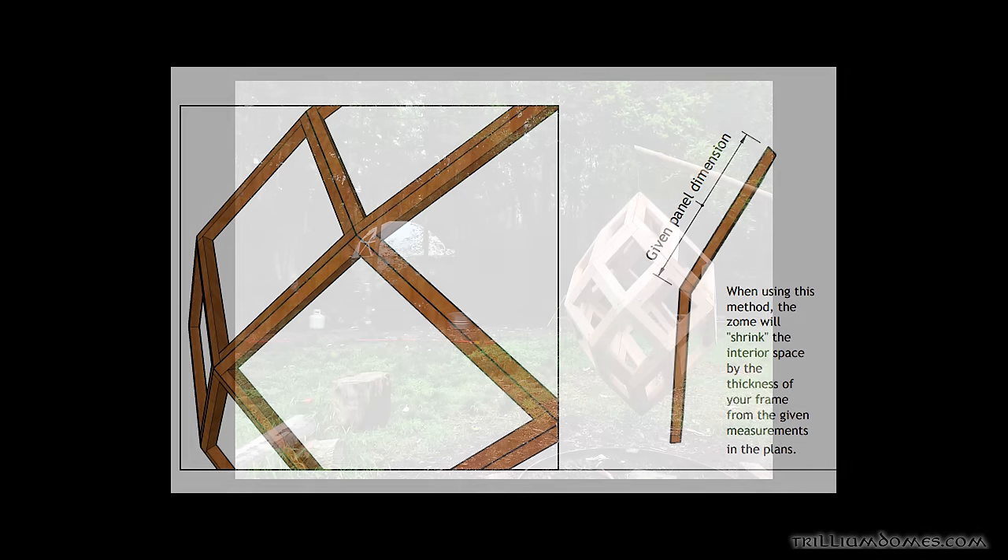I had to button up the skylight before we could start putting the roofing felt on. I went up and trimmed all the reciprocal flashing, put silicone under the overhanging flashing pieces, pre-drilled, and fastened those pieces to the polycarbonate. I also put two more flashing strips continuously over the top to cover up the center, though they do eventually want to get a custom cap made, maybe out of copper.